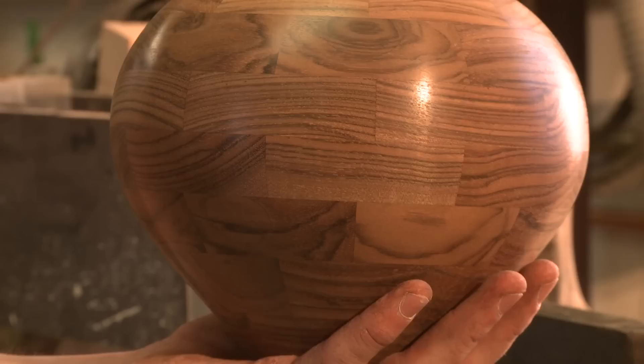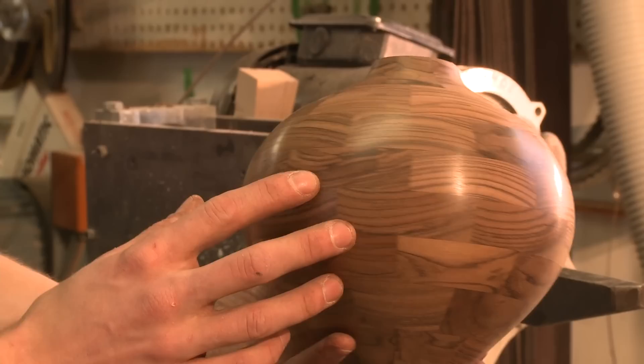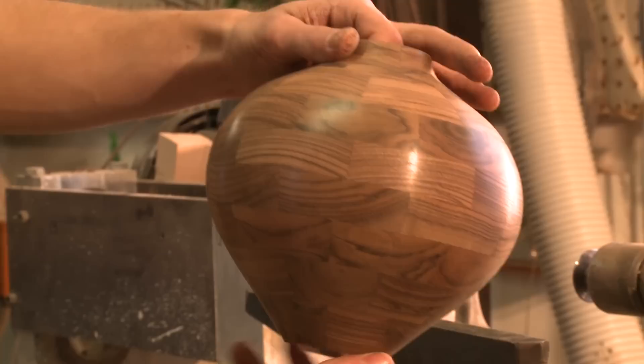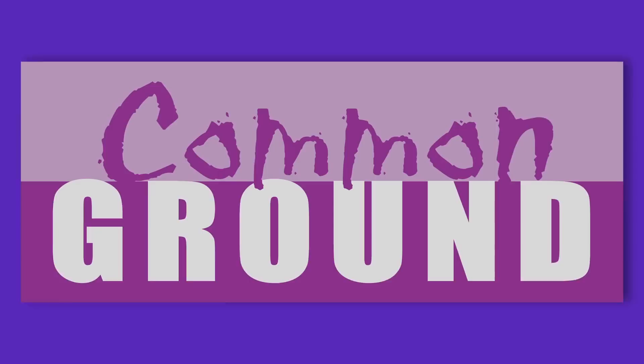That's it for the turning. Now all I need to do is sand this down and take all the tool marks off of it. Now that it's all sanded, we have this ready for finish. Glaze will never come out with a nice wood grain like this. You can do a thing called grain matching — just take a stick and alternate. This one's just randomly assorted and you get to pick your favorite side.